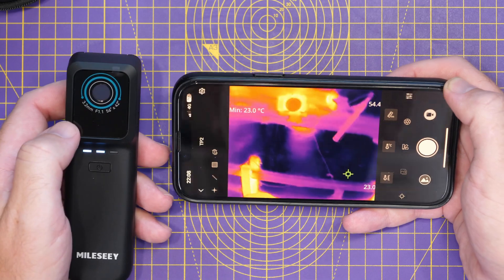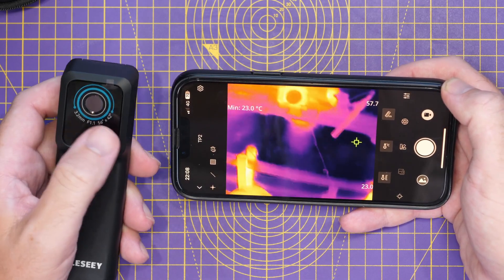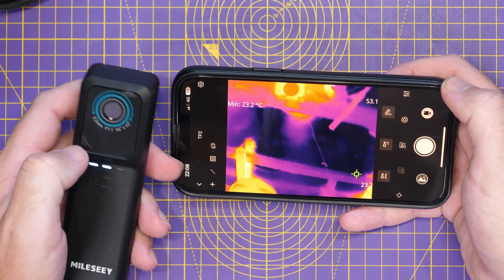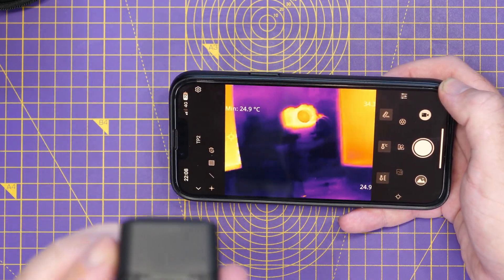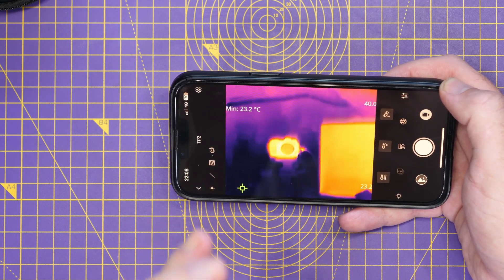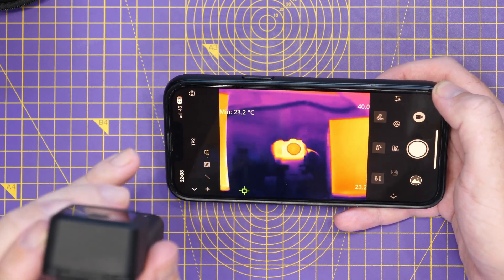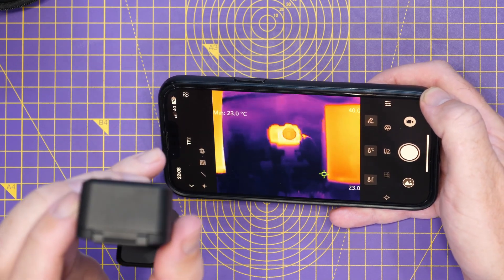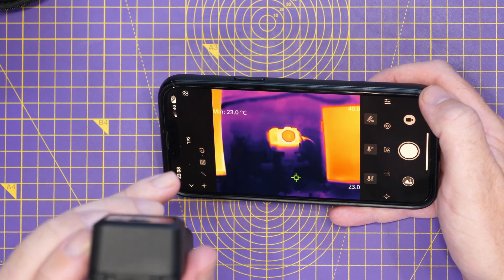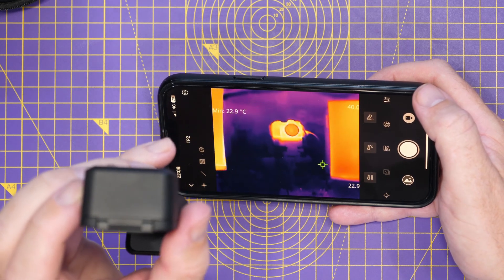On this standard TP2 you only have the thermal imager, which means you don't have the option to combine real-time and thermal imaging on the display. That does reduce the effective resolution available to you — you're limited to the strict thermal resolution rather than having the improvements that the dual-camera model provides. That dual-camera version would allow you to use an MSX-style feature like on FLIR cameras, where using both cameras improves the apparent resolution.